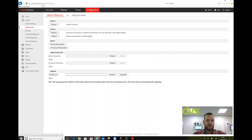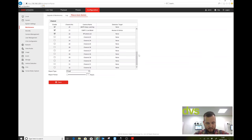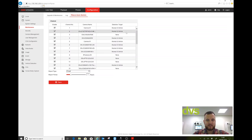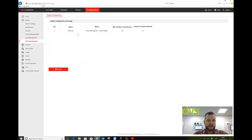Under Maintenance there's a new option — on the non-B version as well — called Filtered Alarm Statistics. Basically we can tick the channels. I've ticked all the ones I've enabled filtered alarm statistics on. There's a report type: email or none. We can set it to every day or every seven days — I'll change mine to every seven days. It tells us what camera is set up and what detection is configured: human and vehicle, body, or none. This is the smart analysis. You need to set the email up first for this to work.